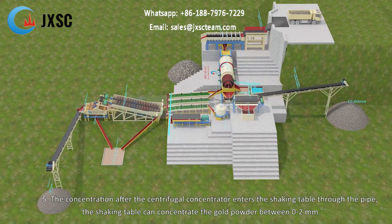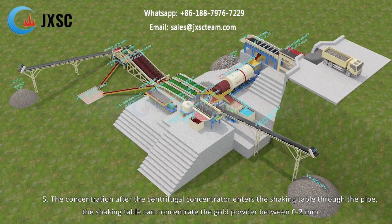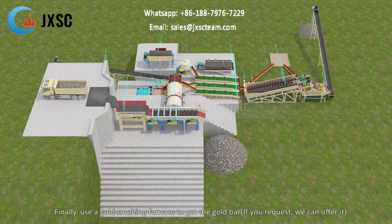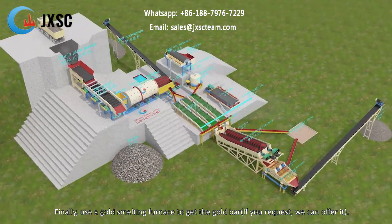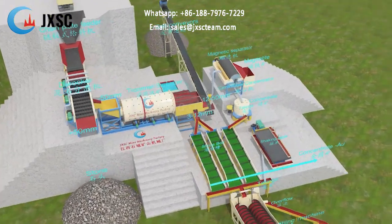5. The concentrate after the centrifugal concentrator enters the shaking table through the pipe. The shaking table can concentrate the gold powder between 0 and 2 mm. Finally, use a gold smelting furnace to get the gold bar. If you request, we can offer it.